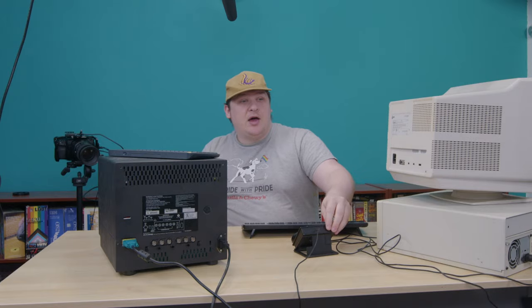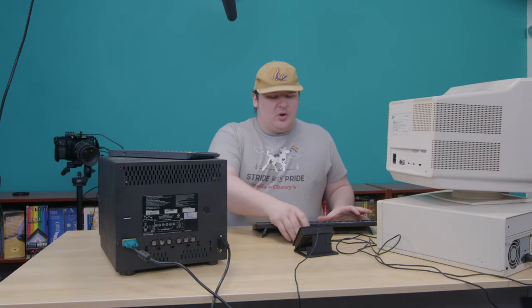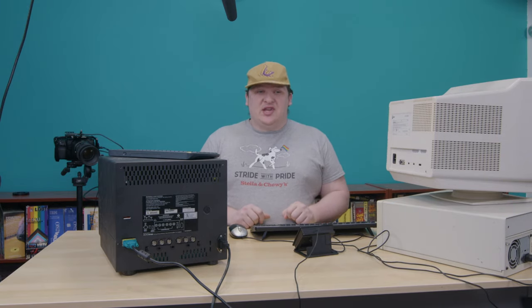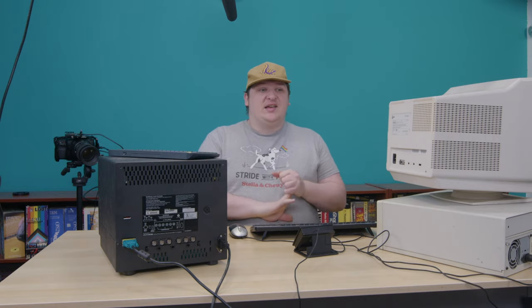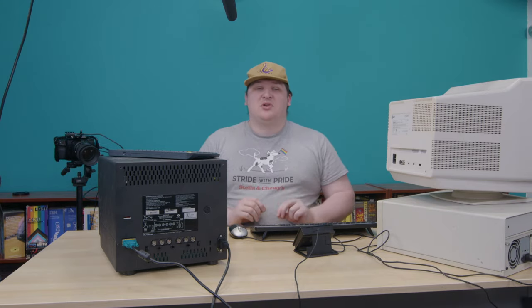Okay, so Helga, I described this earlier, but I assume you were not here. So it is TTL, it's digital. It's not analog at all. So it sends red, green, and blue as on-off values. And then there's an intensity value, which just halves the brightness of the combined color. So a total of 16 possible colors.